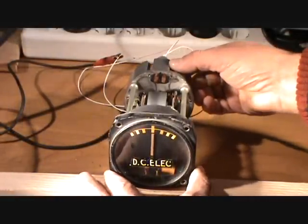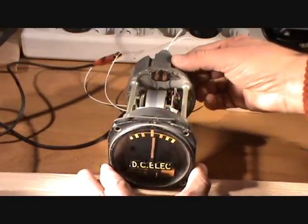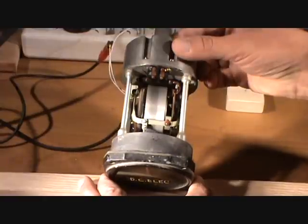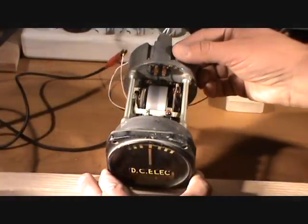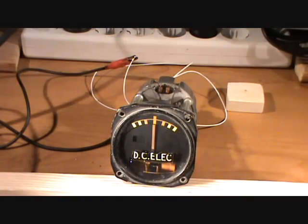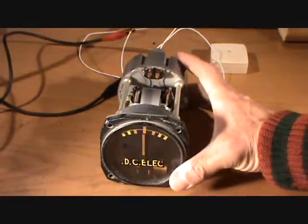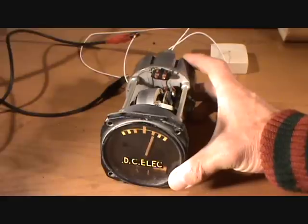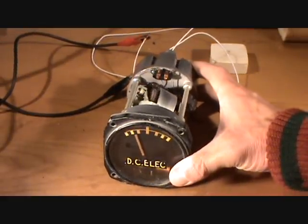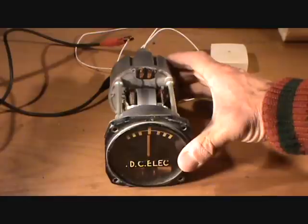If we move the indicator around the lateral axis, the gyro will not react again, as there is no turn, and this movement corresponds to airplane pitch changing or climb and dive. But if we move the indicator around the vertical axis, which corresponds to airplane yaw or heading changing, the gyro reacts immediately, moving the pointer in proportion with the turn rate.